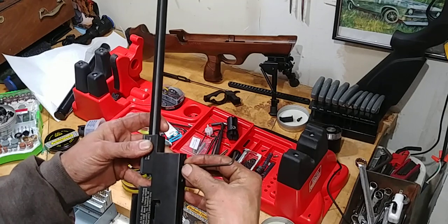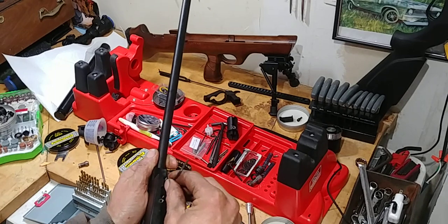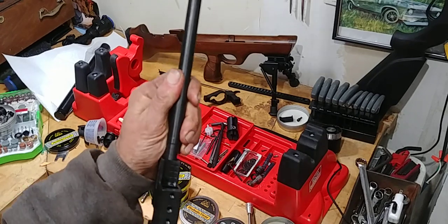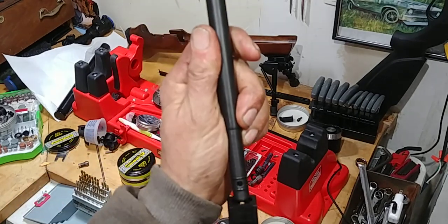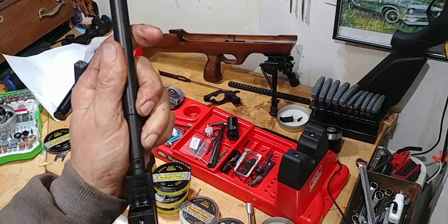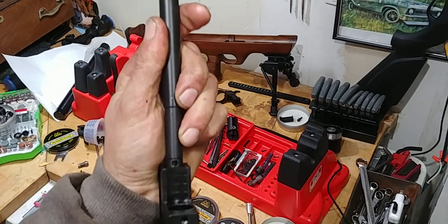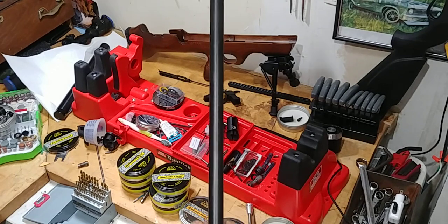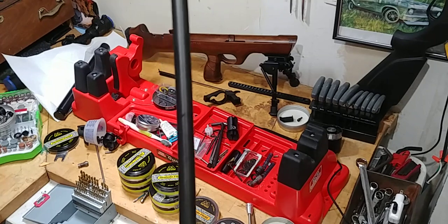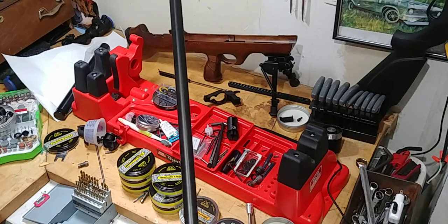And what I like to do is feel around the barrel and see if the barrel is centered with this hole, because that transfer hole on the barrel has to be lined up with this when it's inside. Otherwise, you're going to be half off and not as much airflow. It's going to be a disturbance. So I just try to get that as perfect as possible lined up, and then put my set screws, make sure these are all tightened up, and then I can send the drill straight through.